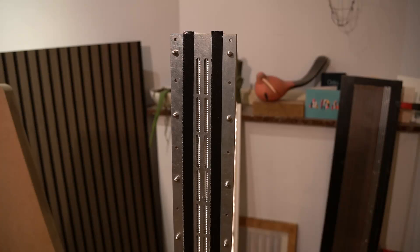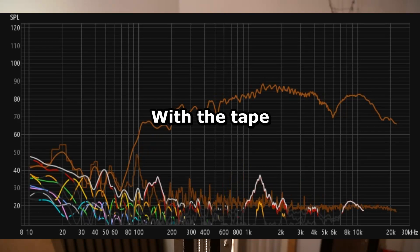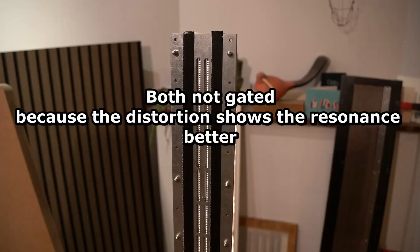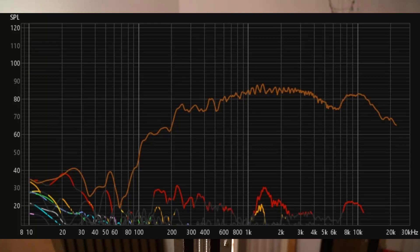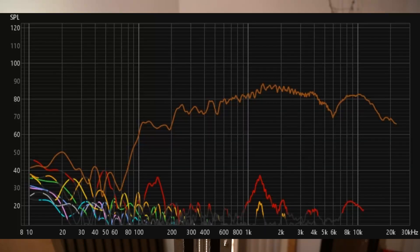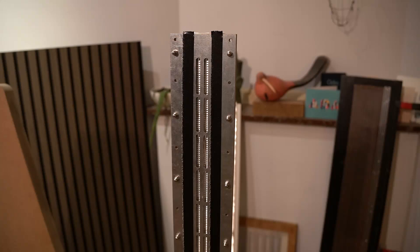You can also see that covering the holes lowers the resonance of the panel — not actually lowering it, but damping it more, which is why it appears to lower the resonance. It doesn't change much regarding the dip I want gone. One funny thing: if you only tape off the front side, the distortion — especially second harmonics — rises. Then with tape on the back side as well, the second harmonics drops again. So the air load front to back does influence the second harmonics.